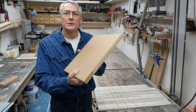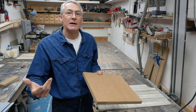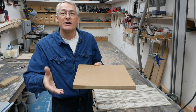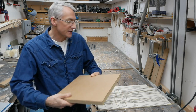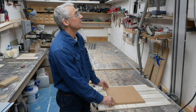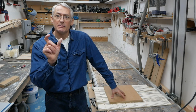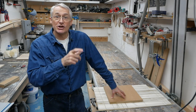Fortunately, that's a really easy test to make. To check this for square, you need the thickest piece of man-made board you can find. 22mm or 25mm MDF is absolutely perfect for this — man-made because it's virtually guaranteed to be flat and stable so it won't change as you cut it. We've got a 6mm spoiler board down here and we're just going to line this up and cut a short strip off, then check that for square.